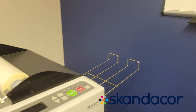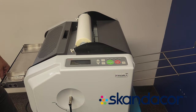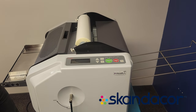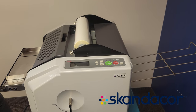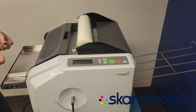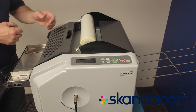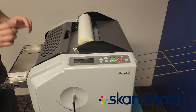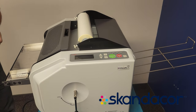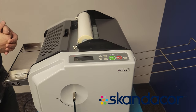You can do this with the rollers hot if you want, but obviously be careful not to get burned. The advantage of doing it hot is that the two pieces of film will seal themselves together and you don't need tape. The disadvantage is risk of burns, and when threading paper through hot rollers there's more drag — the film can crinkle and self-stick together. We recommend doing it cold with tape, though sometimes you don't have time to wait and can do it hot — just be careful.